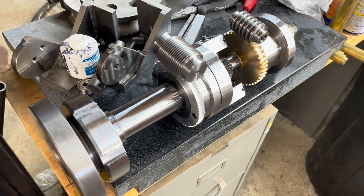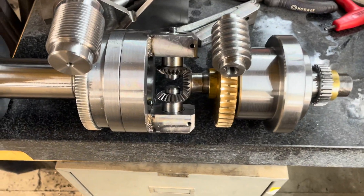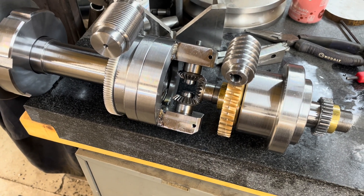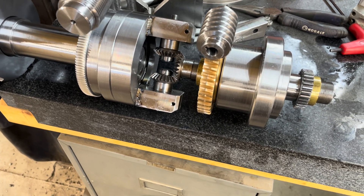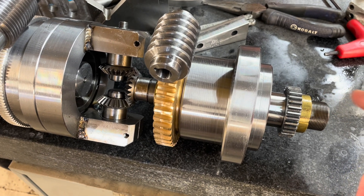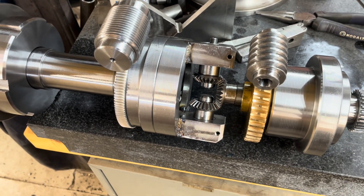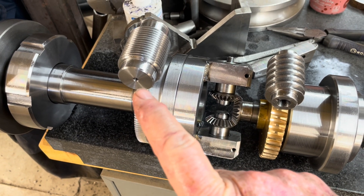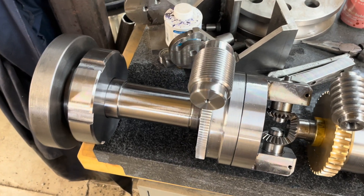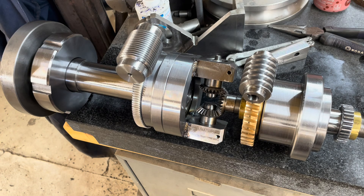This is the inner workings of the lead compensation and final drive spindle for the hobbing machine. It's going to be laid out more or less the way it's going to go, but upside down — the worm drives will be on the bottom in the final version. This is the output assembly that feeds the feed train on the table and also feeds the differential. The signal comes from the feed train through a set of change gears to the compensation worm, which adds its motion to the motion from the index train and drives the final spindle. This is looking pretty okay.